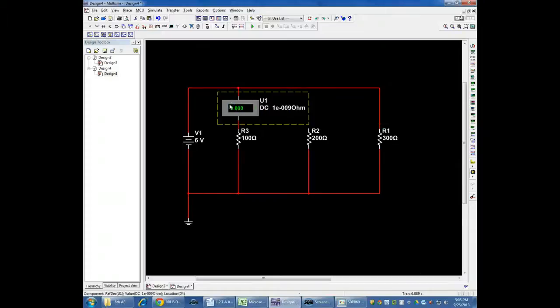Copy this one, paste it in there, connect that. I'll stop with 2. The third one's going to be the same way. And none of these are my total current. Remember, they were different on each one of these lines. And so if I want to do my total current, I need a meter that's right here.